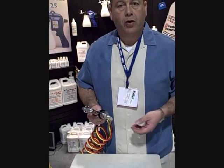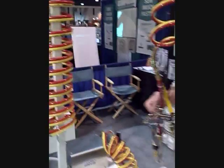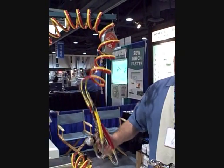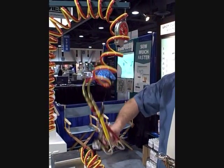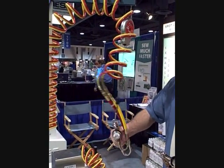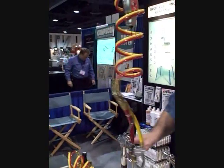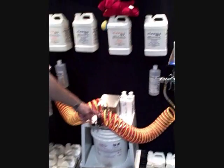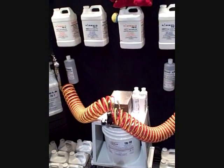On the smaller systems, which we'll get to in a minute, when you change the bucket of glue, you just put some hot water in it. On the larger systems, we have the ability to have a gun that's reverse-plumbed to hang down over the press. This can be set up with an arm on a nice weight balance so it can't fall. This adds a couple hundred dollars per gun to the system. We also have a multiple-head system with a manifold — we can run up to three guns and plumb them for multiple presses.